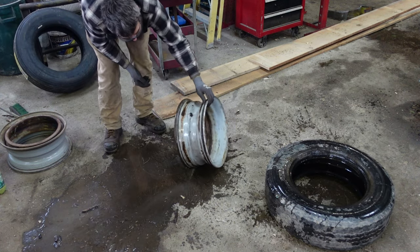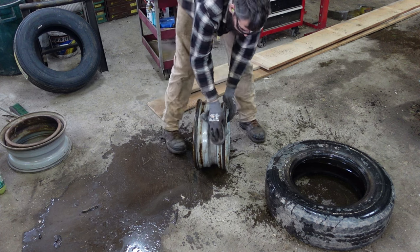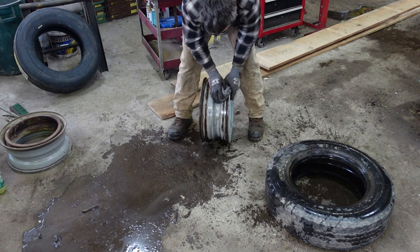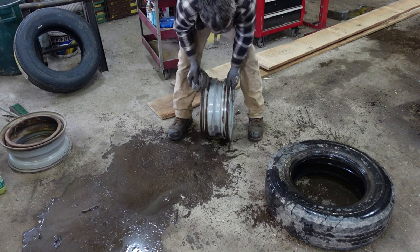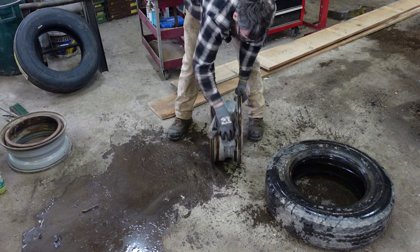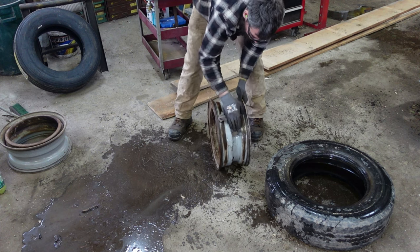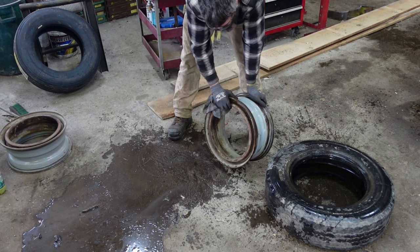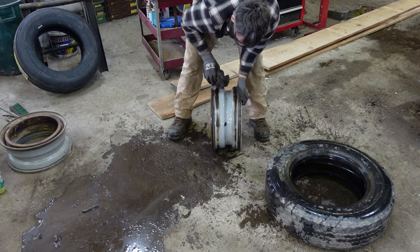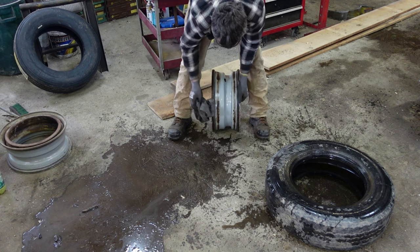There's my rim. These are Daytons, but it works the same on all the different rims. The Daytons are just the ones that are hollow in the middle. They're a little bit of an old school style. Kind of like them, if you know how to mount them. They're a little bit lighter to handle because you don't have as much steel. They aren't fun, but up the center there's a little bit less, and they don't have the ridiculous bolt torque. You can do them with a ratchet on the side of the road if you have to. A lot of guys don't like them because if you don't true them properly, your wheels wobble all over the place, and that's terrible.